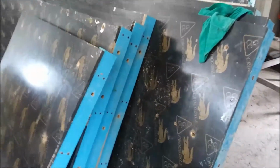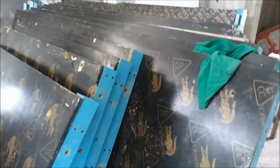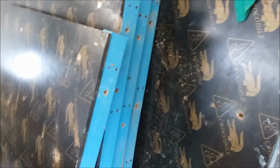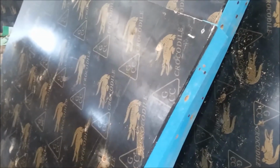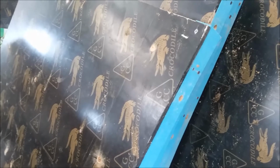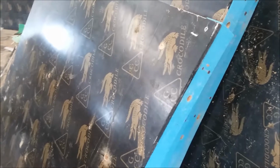Since we're now doing a walk-around video, we've changed the title. Those are the ones that Oriel built last week. He built 8 8-foot forms, 4 4-foot forms. And we already had a couple of shorter ones. This way we can do the entire cistern like a rectangular shape, with the area around it, in one pour. The cistern is the biggest pour we have. It's a fairly large hole. 37,800 gallons U.S.